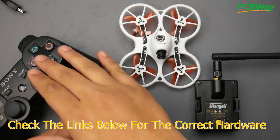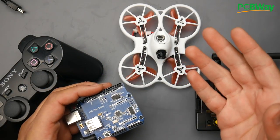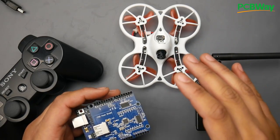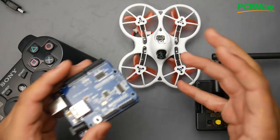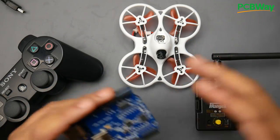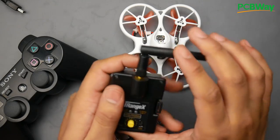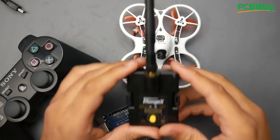The way this works is it takes the USB input, the library decodes all the buttons, and we tell each button what to do in the PPM value. I found a PPM script online — I have everything linked — and I merged the USB Host Shield library with the PPM script to output PPM to a multi-protocol module.